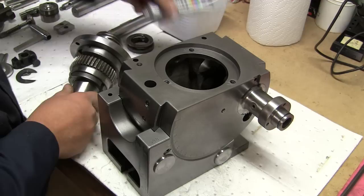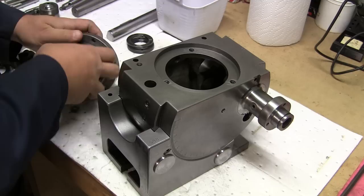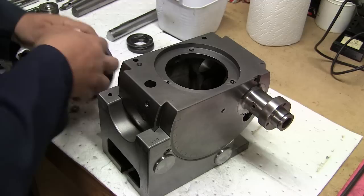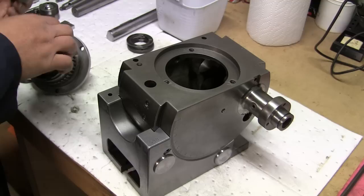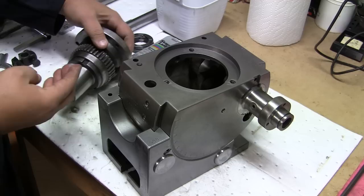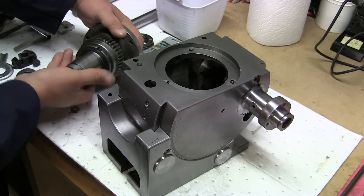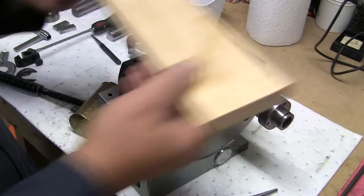Next piece is going to be the spindle. This was a little tricky to get out — it needed a little bit of persuasion, gentle persuasion. I'm just greasing it up a little bit. I got it started using a little piece of wood and just gently tapping it. I pushed it down enough to put these screws in, just to get them started, and what that's going to do is it's going to prevent this thing from rotating on me — at least that's the idea.